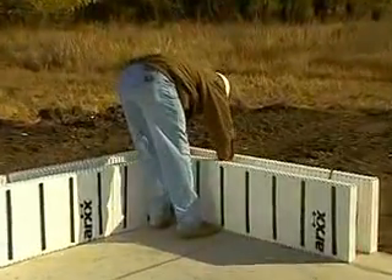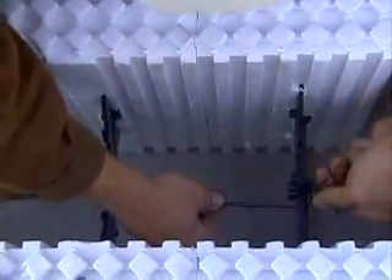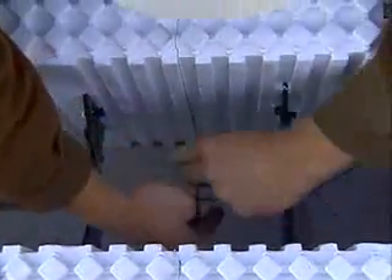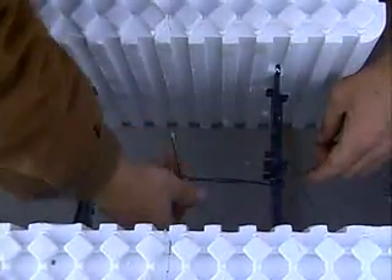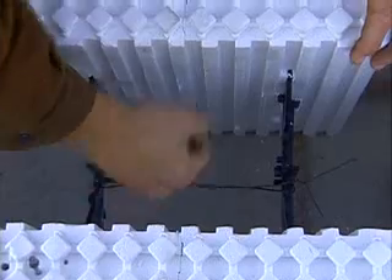The pressure of the fluid concrete will generate the greatest forces at the corner form, so it is a good practice to wire the corner form to the two adjacent form units. Run a tie wire between the webs of the two forms. Pass a nail through the tie wire and twist it until the wire tightens enough to create a slight bow in the webs.